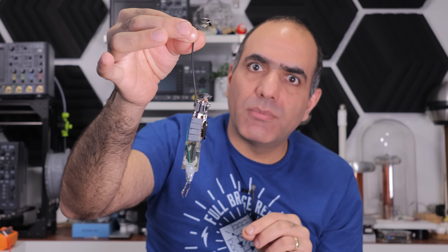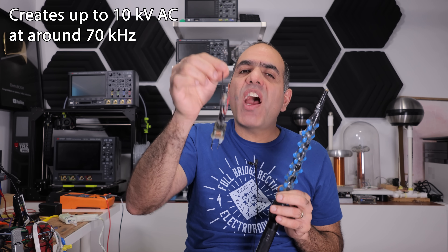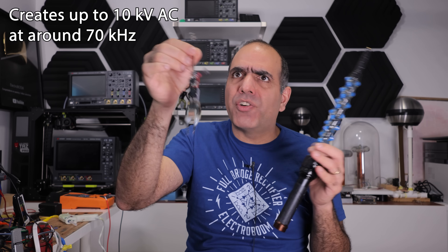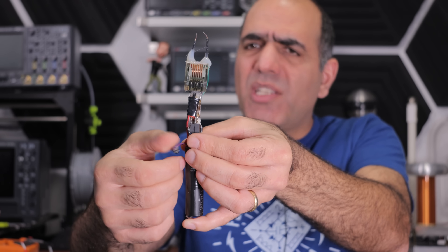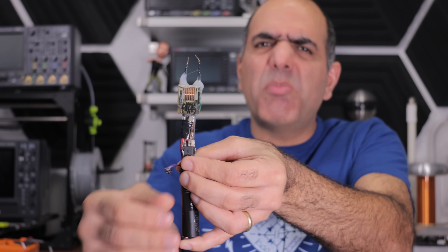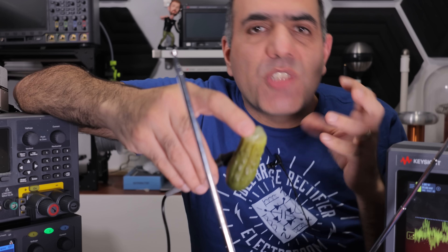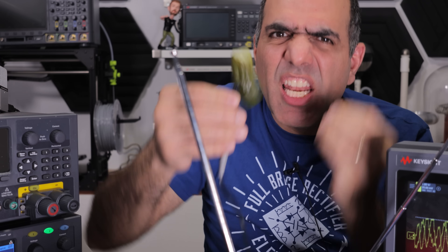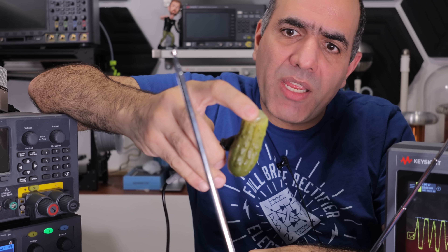You may remember this — it is the gut of my electric magic wand I made a while back. What it does is it creates 5 to 10 kilovolts of AC output at around 70 kilohertz. It doesn't make much noise because we can't hear 70 kilohertz. Otherwise it would be very loud as it slaps the air on and off. Although 70 kilohertz can burn, it is well above the level of electrocution by shocking, so I should be able to hold on to the pickle directly.